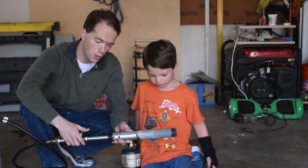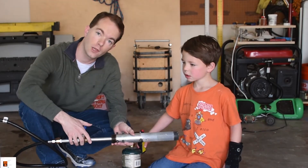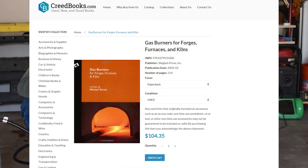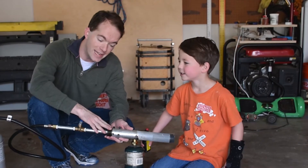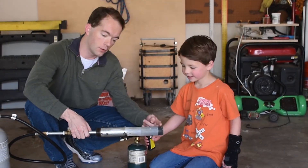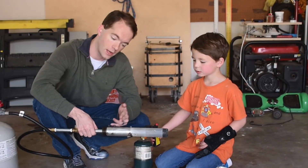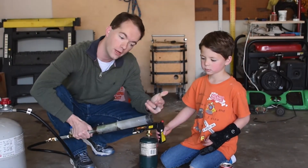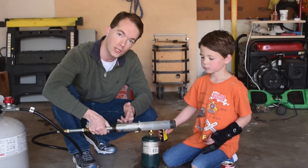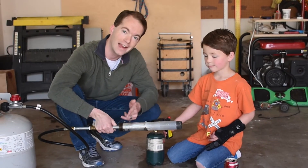It does sound like a jet engine. Let's go ahead and fire it up. What I did was I actually found this book online — a snippet called something like 'Gas Burners for Propane.' I think Michael Porter is the author. You should definitely check out this book. I learned that the gas needs more time to mix with the air. A 9x is what the book recommends — nine times your tube diameter is how far you need before you actually get to your nozzle. So I had to move my nozzle back inside the tube 10 inches to get the 9x that I needed.